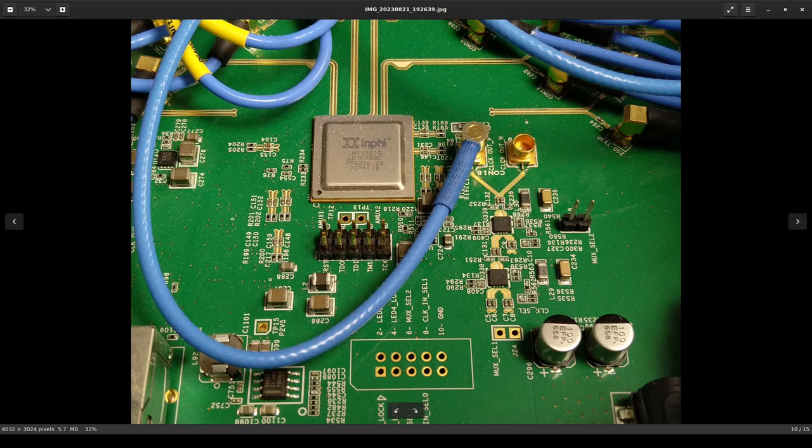The output is AC coupled. There's a 2-to-1 mux with a test point on the mux selector, then another 2-to-1 mux with another test point on the selector. So it looks like there are three options for a reference clock out, which tracks with the block diagrams I'll cover in a moment. There's also some power regulation — nothing too exciting. All of the meat is in the InPhi chip.